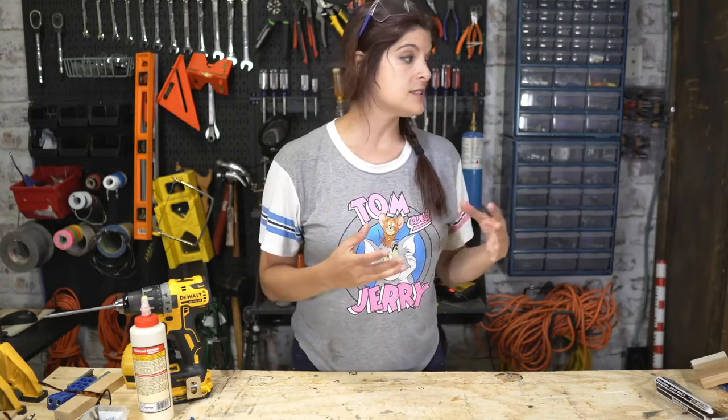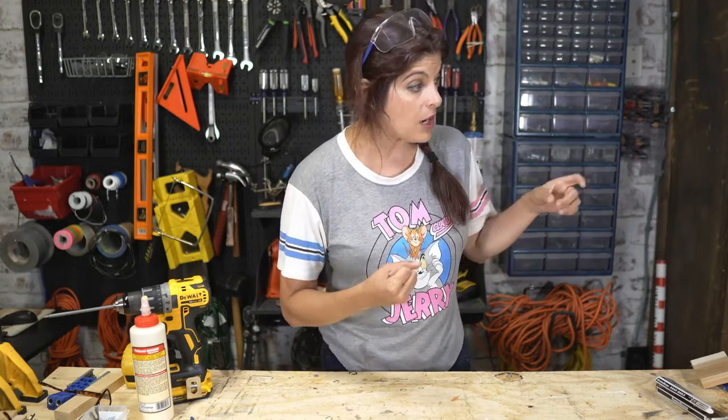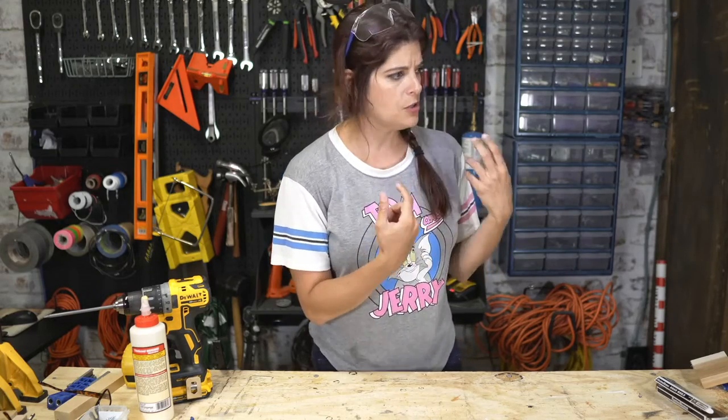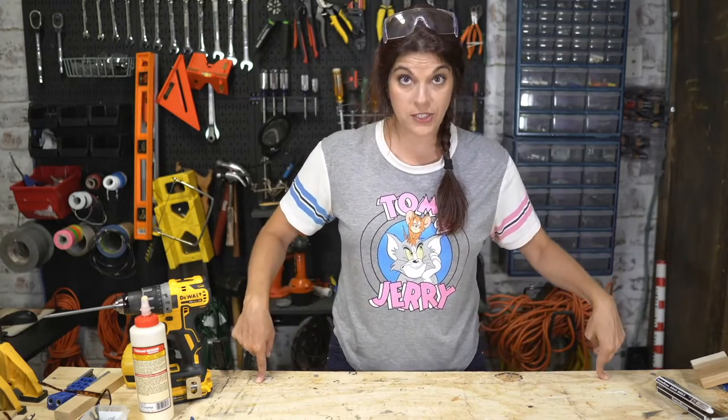So I want to leave it such that I can unscrew the top and replace it with another top. Once the top is in where I want, I'm going to clamp it down. Then from underneath, I'm going to use 2.5-ish inch wood screws. Not the pocket hole screws, but regular wood screws, and drive them up and screw them down this way. Like on my workbench, you've seen screws driven this way to hold it. It is not glued down. That way I can beat the top up as much as I want, unscrew it, and then put another fresh top to it.